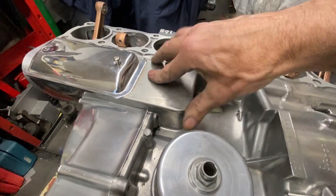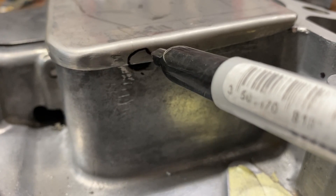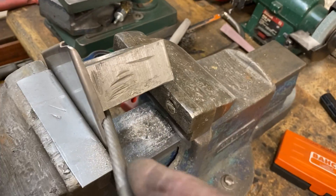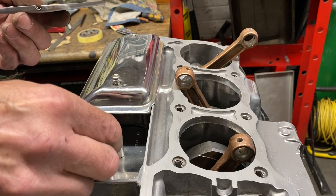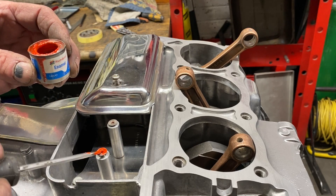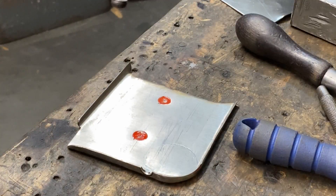A quick try on the engine and it fits lovely — the curve is absolutely perfect. At the right of the back there's a wire that comes out from the oil pressure switch, so I need to file half a hole to match the half hole in the engine. I just mark that with a pen, take it across to my vise and file it out with a round file. With the half hole filed, it's time to mark out the two central holes for the screws to hold the cover plate on. To do this I place two M5 countersunk screws into the M6 threads — they just drop in. Then using a bit of paint, I drop a bit of paint on top of each screw, put the cover on, press down, and when you lift it off you've got two dots. Using a centre punch, find the centre of the paint, give it a tap, do the second one and it's all ready for drilling. For drilling I use these special drills for sheet metal — they're absolutely brilliant because they start off small and gradually get bigger and bigger, and you stop at the size that you want. The main thing is they don't grab and they don't throw the job around. If you use an ordinary drill on sheet metal it just grabs and shoots through too quick — this is just a nicer way of doing it.